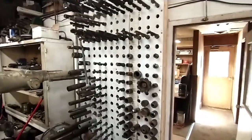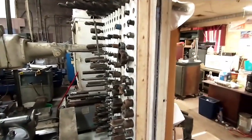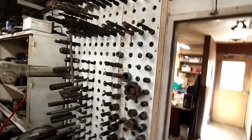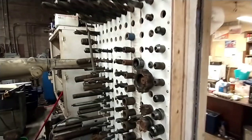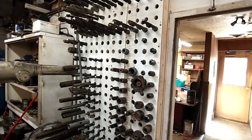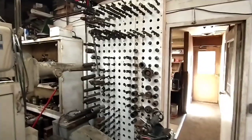So anyway, by the way, guys, I don't remember if I showed you this, but I finally got sick and tired of the disorganized mess with all my tooling and made ourselves a pegboard. It turned into an enormous project. It's some old truck van sides, 3/4 inch plywood with fiberglass facing, which proved to be the first problem. We hole sawed all them in, itching for a week from all the fiberglass we released doing that. So it's 2 chunks of that with 2x4s in between and then spaced off the wall with furring strips. It works great, but it took, I think, about 6 hours to hole saw them holes in. It was a thankless job. It was one of them where if you'd have known ahead of time how bad it was going to be, you wouldn't do it. But once you're halfway done, you can't quit. But anyway, now that's done, it's nice.